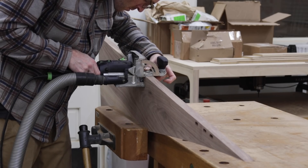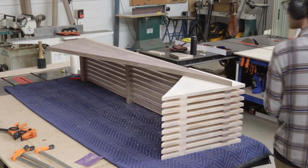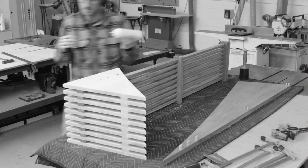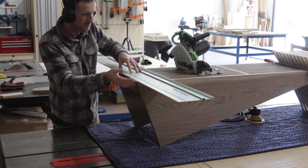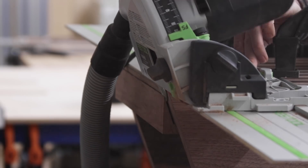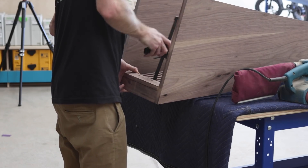I clamped the two side panels in place and got a first look at the bench as a whole, then I could start marking out where I'd be cutting in the dominoes. Using dominoes was definitely a quick and accurate way to attach these, but I still needed to be thoughtful — I needed to use multiple domino sizes and plunge depths depending on which joint it was. I think I used three different sized dominoes and multiple plunge depths to ensure I wouldn't be cutting into any screws or plunging too far. Once I had everything figured out and all of the mortises cut in, I could glue on the two walnut panels. I did these separately to avoid trying to flip the entire piece over during the glue-up.